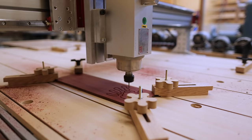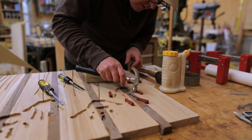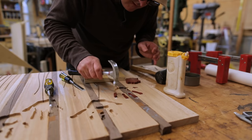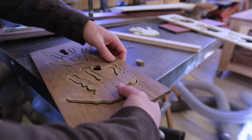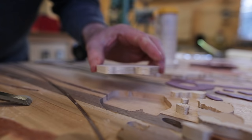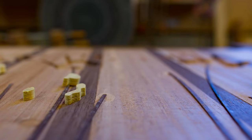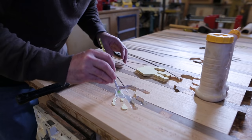I've seen cutting boards done with a three-degree angled bit so the piece gets tighter as you push it into the hole, but for these I just did a vertical cut for now — I think at some point I need to figure out the angled-side routine. After cutting, the hands often weren't quite ready to go in the holes — there'd be a little burr or a fuzzy patch. Some of the tight inside corners needed to be rounded down to fit into the inside curve. And this is the first time I've used a brush to lay down glue.